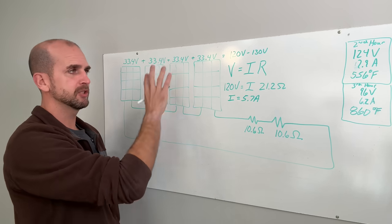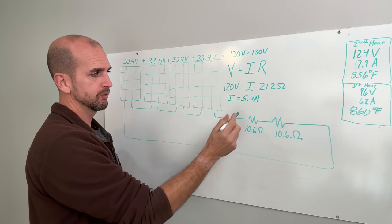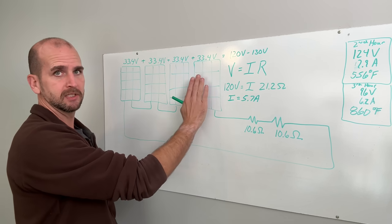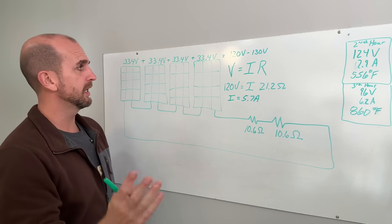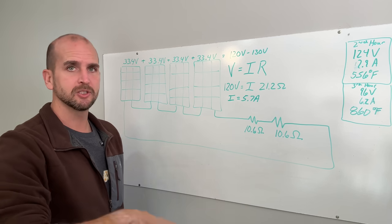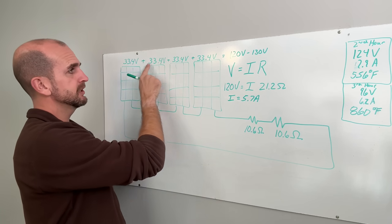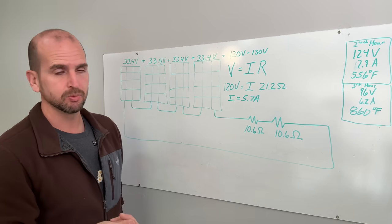So we just finished up that third hour but I want to take a second to make sure you understand what's going on here. We have those four solar panels wired in series. Then we're just running that through two resistors in series — those are the heater elements inside the sand. Now the solar panels have a rated voltage under their maximum power point which is set at 77 degrees Fahrenheit for the surface temperature. As the temperature goes down it can actually go up — solar panels will produce more power when the temperature is lower. This is dramatically going to change with how much cloud cover you have, if there's some haze in the sky, where the sun's at, how your panels are positioned, how they're tilted. In almost perfect conditions we're getting 120 to 130 volts from these four panels in series because when you wire in series you're just adding up the voltage and you're keeping your current constant. Parallel: voltage would be constant and amperage would be added up.